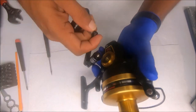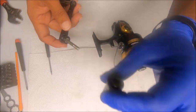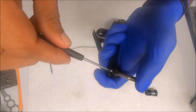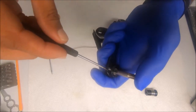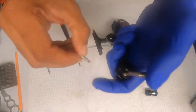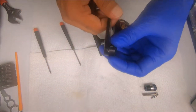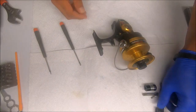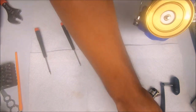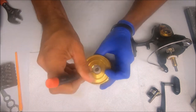First I'll start with the handle. This particular one comes off the sleeve where the collar unscrew to remove the pivot. Usually these things are stuck, or the screws are stuck in there. You can soak them in oil or use a little bit of heat to help loosen it. Soaking in oil should help — just let it sit for a while.